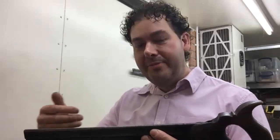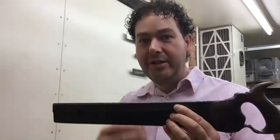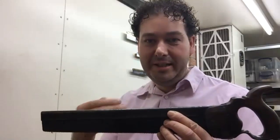So it's not like buying a really good plane iron, like Bill was explaining last week, where the old plane irons were brilliant. They were. The steel was unbelievable. They hold an edge brilliantly. But with saws, the steel actually gets harder and harder and harder as time goes on. Not through rusting, just through aging. And this is why you can end up with old saws that when you come to set the teeth, you can hear the teeth snapping. Now, they weren't snapping when they set them originally, but just over time, the steel's got more brittle. And also, the steel starts to lose the ring, so you get a dead sound to the steel itself.